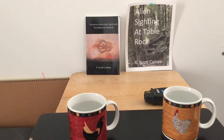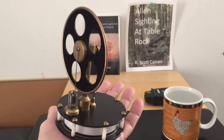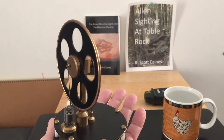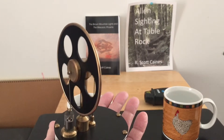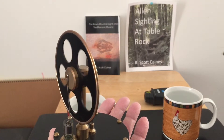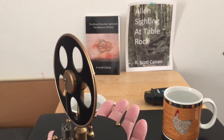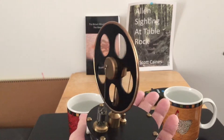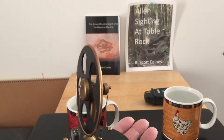Something I'd like to demonstrate: the Delta T — the difference in temperature between the bottom and top — is what gives it the energy to drive the piston, causing the expansion and contraction of the air inside. As you can see, it's running off my hand because my hand is warmer than the air temperature in this room.